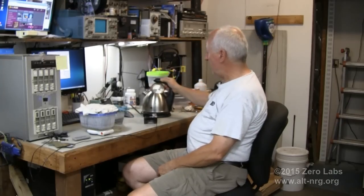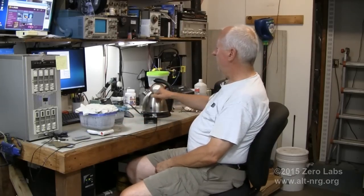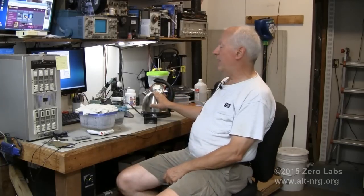What I've done, instead of following Armin's directions precisely and putting new caustic in the bottom of the containers each time I want to steam the plates, I simply take the caustic solution — which is about 30 grams per liter — and pour it directly back into the stainless steel coffee pot, reheat it, and once it's boiling, pour it back in, seal it off, and let it do its work. I've done that three times to the plates now, and you are about to get your first look at the six plates I've been working on.